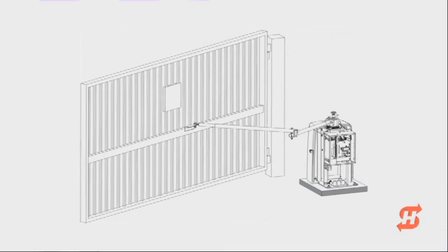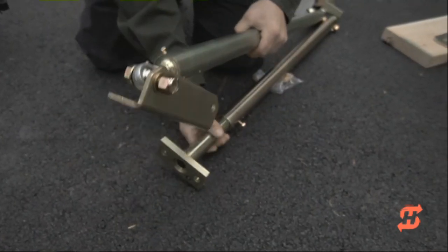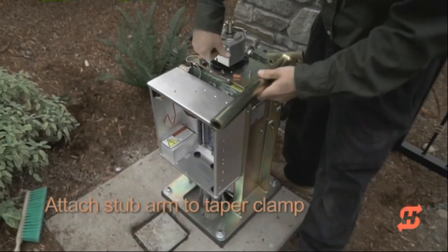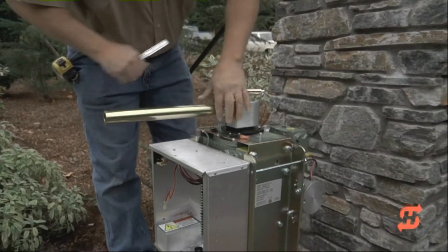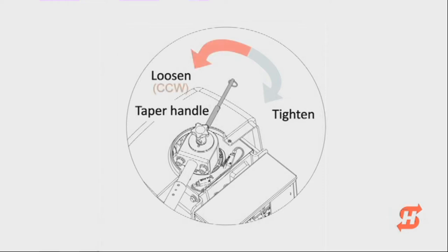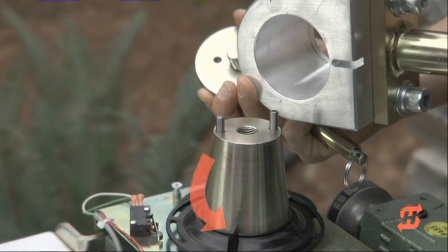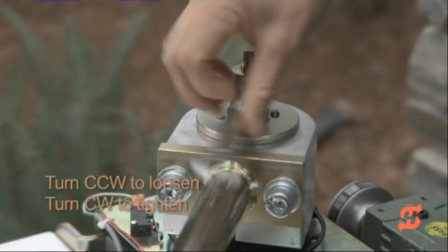When the operator is properly secured, it is time to attach the arm assembly. Unpack the gate arm assembly and slide the stub arm out of the short tube. Attach the stub arm to the taper clamp with the fasteners provided. Secure using a socket head or Allen wrench. The patented taper clamp lets you set the breakaway torque in the event of a gate strike. Turning the taper handle clockwise applies pressure to the coned interface; counterclockwise releases the pressure, allowing the arm to swing freely. Be sure the black fin extending from the limit plate aligns with the slot in the aluminum block, which assures the limits track the arm position.